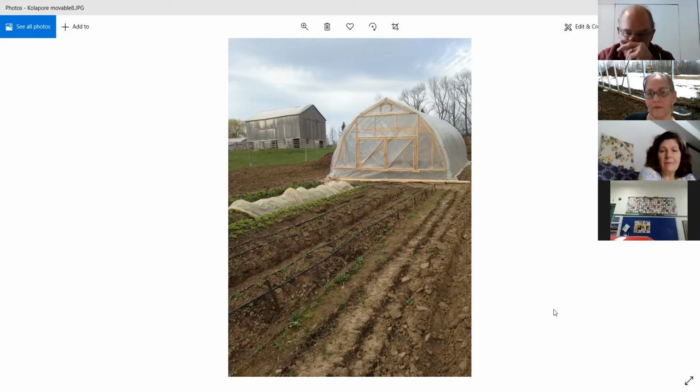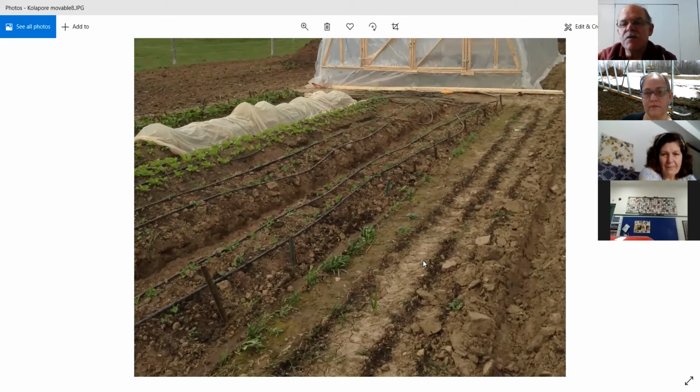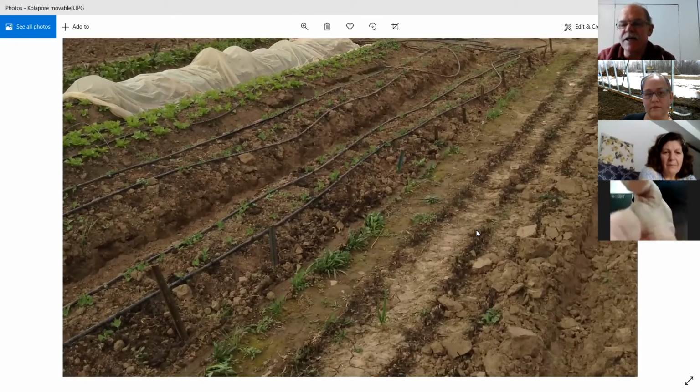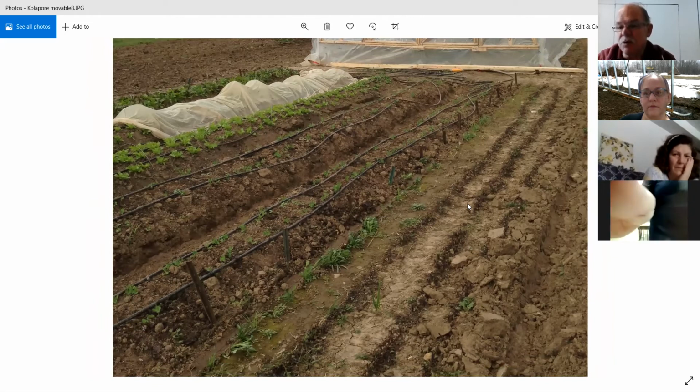But one thing that this slide also indicates, and you may or may not be able to see it, is that there is a row of anchor posts standing there already. Because when you're moving a structure and releasing it from the anchors for a short period of time, that structure is very vulnerable to changing weather conditions. So you need to be ready. If you don't have a double set of anchor posts, what you need to do is take some of your anchor posts out of the ground and do a few test pounds, especially if this is the first time that you're moving there, just to make sure that you're not going to encounter an insurmountable object. So this all comes back to being prepared.